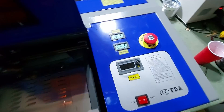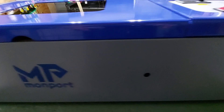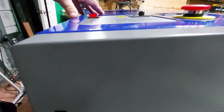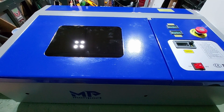You need to turn the emergency stop button to the right in order to use the machine, then power it on and off with the red switch in the front. On the side there's an opening for the USB connection. A useful tip: put a magnet inside the power supply bay to keep all the screws you remove, and store small items like your focal gauge there so you don't lose them.